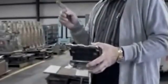Here we get some new tooling for the wingtip. Some sharp aids. But like I said, we've been in full production on all composite parts, including now a composite graphite dorsal fin. Here is the drill fixture that I mentioned for the landing light, which is different than the original one, different part number. Anytime you change something on an aircraft, you have to create a new part number, even if that part has two different holes in a different location. Sometimes, not all the time.